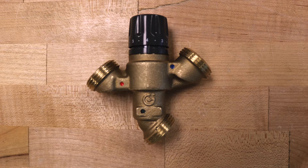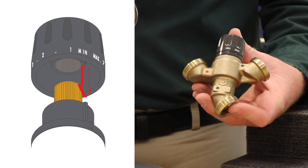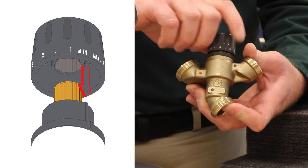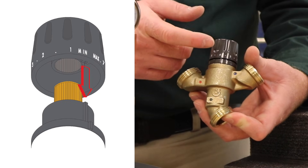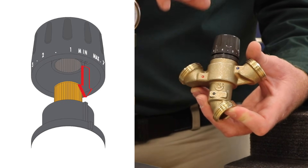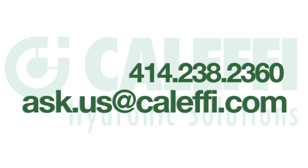Now that you've got your tank mixer assembled, everything is tightened down, and all your connections are made, we're going to go ahead and make the adjustments to your mixed outlet temperature. Your 520 series is going to have an adjustment knob with adjustments from minimum to maximum that correlate to roughly 95 to 150 degrees. You'll want to realize that this knob is just going to be a reference, so as you make your adjustments, you will want to confirm the mixed outlet temperature at a fixture in the home. You'll notice there is an index point that gives you a relation to where you have the knob set. A unique feature of this, along with our 521 series, is that the knob can be removed and you can actually lock the knob in place to prevent tinkering after you've made your installation. I hope you found these tips useful — if you have any further questions, be sure to contact your wholesaler, your rep, or us directly. Thanks for watching.